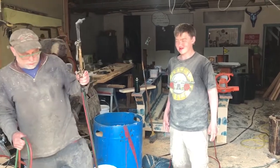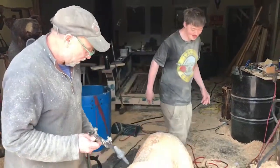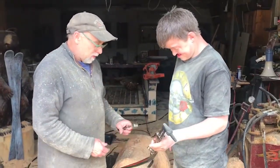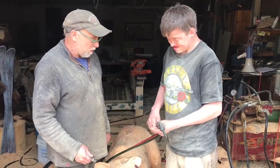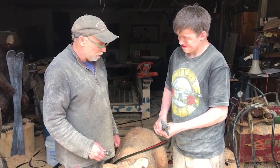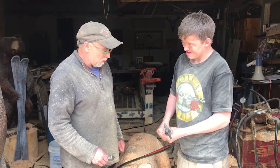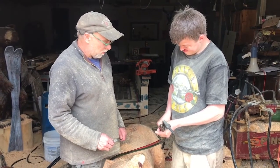That's two good rules. Okay, so come over here, Mikey. Okay, so hold on to that. So you're going to turn that oxygen. This is the oxygen. That's the propane. Turn that one on all the way, that oxygen. But don't do it too tight because it's brass fittings, so we don't want to wreck them. Just turn it till it's open. Yeah, that's open. Okay, now you're just going to crack that one just a teeny little bit. That's too much. Just a teeny little bit.